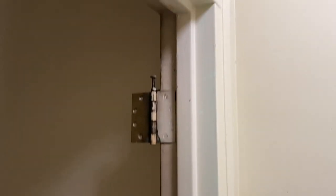There are generally two reasons why you would want to replace conventional hinges with a continuous hinge. Number one would be if you need to repair the door. If you need to move the door side to side or up and down, you cannot do that with these hinges in a commercial door because the door is metal, so you can't move the hinges on the door, and the jamb is also metal so the hinges cannot be moved. In that case, you would get rid of these and install a continuous hinge, and then you can move the door around.